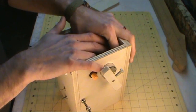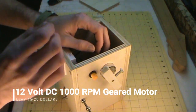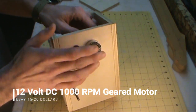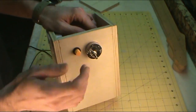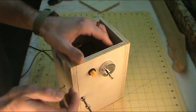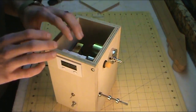The motor I bought on eBay — I want to say it was right at $15 to $20. It's a 12-volt DC, 1000 RPM geared motor. When I say geared, it actually has gears inside. A lot of people build one with the motor sitting there and a pulley going to another pulley for mechanical advantage, but this geared motor gives you that mechanical advantage built right in.